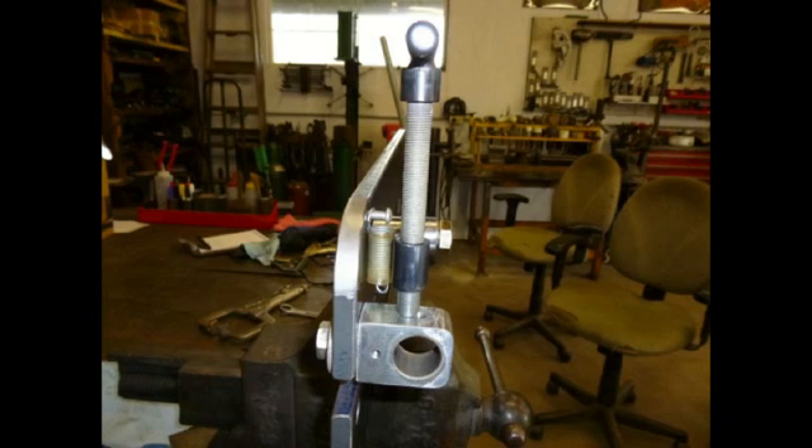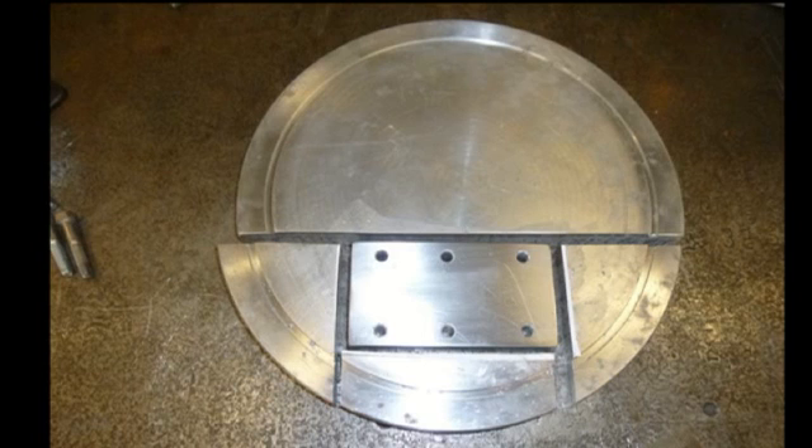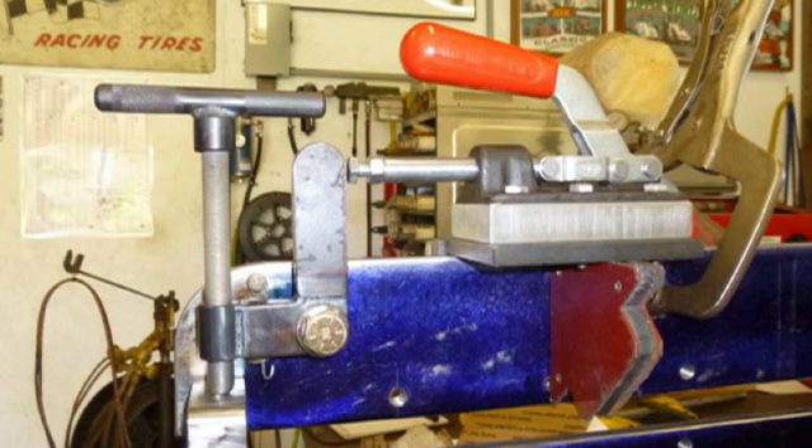I tried to get the T-handle bolt — the adjusting bolt — as close to the center of the shaft as I could. I needed to raise the quick clamp one inch in order for it to hit the bell crank in the right place. I took an AutoCAD drawing and glued it to a piece of aluminum, then transfer punched and cut it out with a bandsaw. Here is the quick clamp in the pedestal all put in place, ready to be welded up.